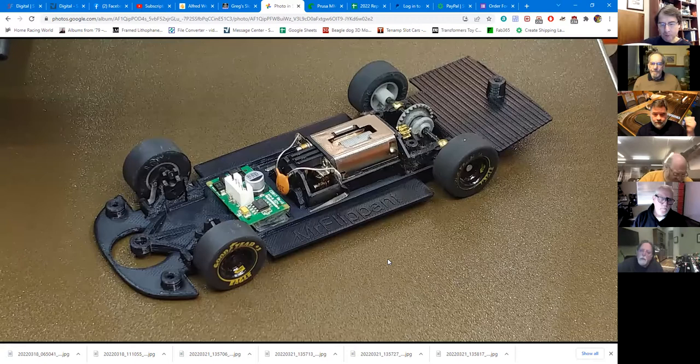the Car of Tomorrow chassis, by me taking a picture of the chassis from up high, straight down. So I was basically scanning the chassis with my camera, with a ruler next to it. And then I could use that in my CAD program as a template for drawing the outline, figuring out where the screw posts go. And then I would do extrusions and do other things to add to it. And I was constantly using my calipers with the actual chassis to measure things and make sure that they're in the right places. But in order to print something, you have to have a model of it.